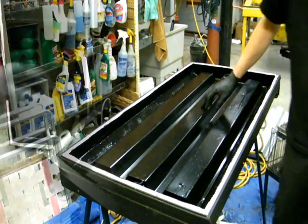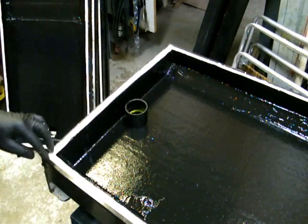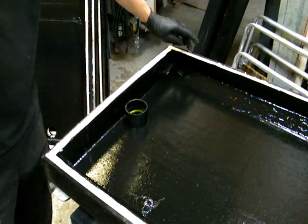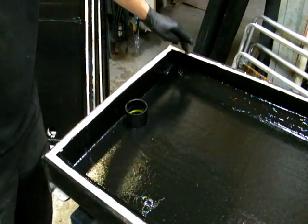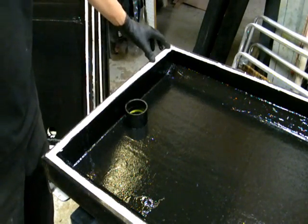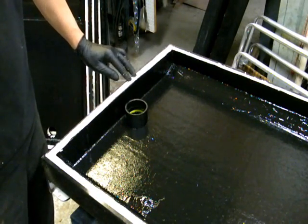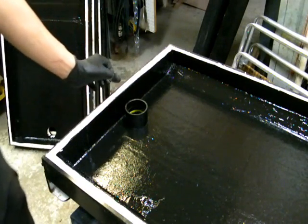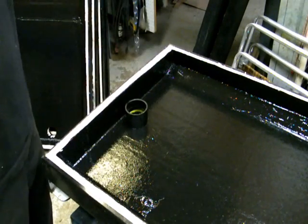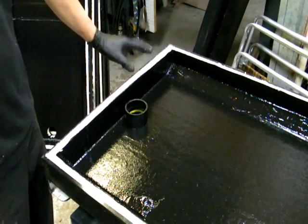Then we're going to put some glass on. I wanted to make a note — the reason why I didn't paint the foam on the outside is I wanted to give myself a little bit extra in order to put the caulk into it, so it's going to adhere to the foam as well as the metal. These pieces of foam are tucked underneath the lip all the way around. Once I caulk it to the glass, it's going to keep the integrity of the entire unit — nice and rigid. I'm also going to be putting some vinyl tape over the outside just to seal it off, then a final paint all the way around. That way it's all nice and sealed with no moisture getting in.